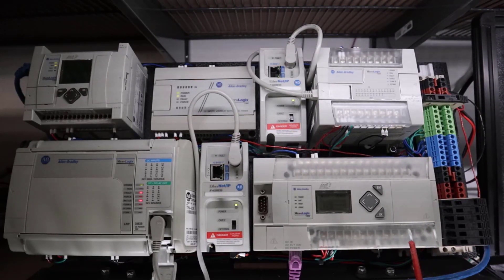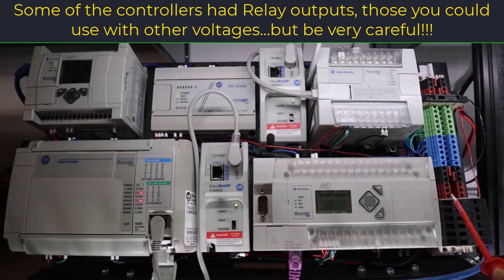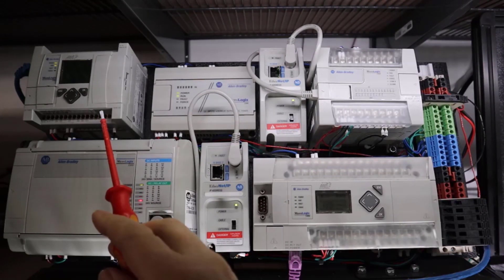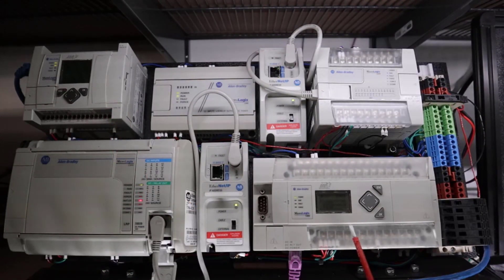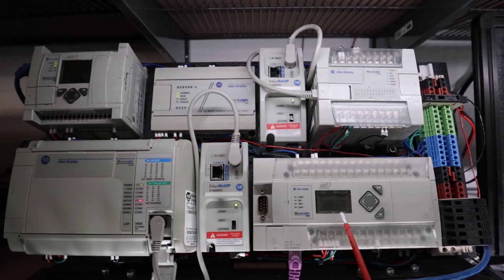In this case I just have terminal strips that I can connect to simulators. For a good starting place, the least expensive option is probably the MicroLogix 1100 with Micro Starter Lite — the money you save on software will cover any price difference. But if you're really serious, buy a used MicroLogix 1400 for around $300–$400 and Micro Starter for just under $200. For about $500 you've got a solid start.